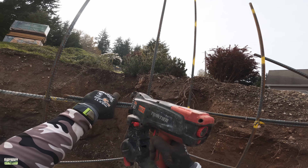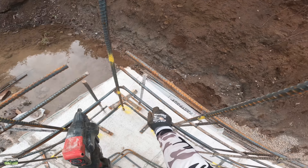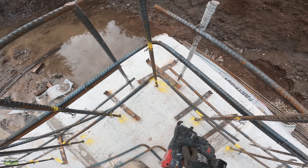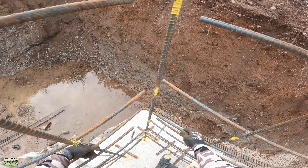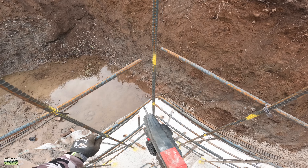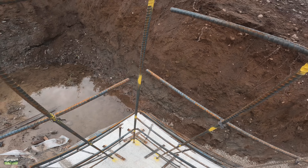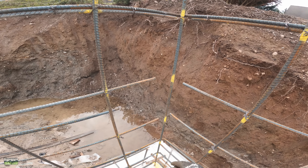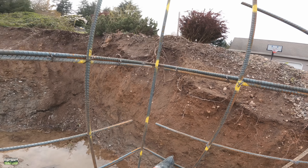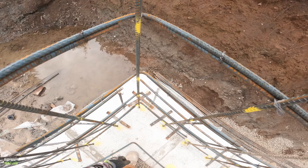What I would do next time is order these mostly pre-cut for every wall length, but I love the 24 by 24 corners because as you could see there it allows me to dial things in. We had tied some angled steel just to keep things relatively straight and plumb, but we're still going to pull that all together at the corners by checking plumb each way. Same thing as the other bar — I'll go about eye level, once that's locked in then I can just go without really thinking from that point down. Not a lot of rocket surgery here — just do it right, make sure you don't have bars tied on the wrong side of bars, and try to make it look pretty. There's another look at the paint that allowed us to line up the grid. Looking pretty clean.